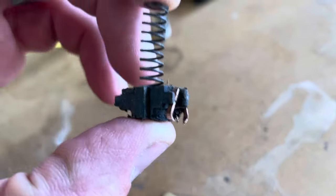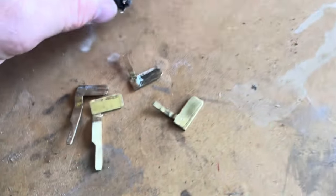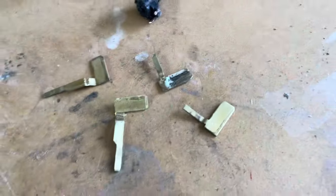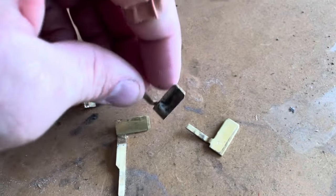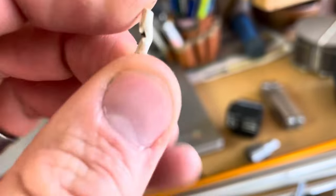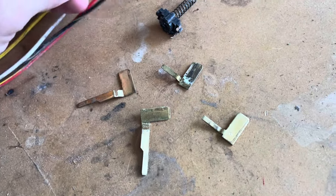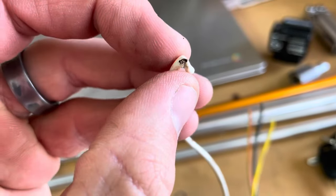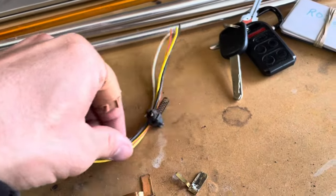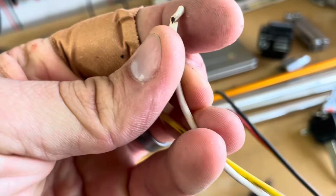Inside, you have a little spring for the seat — a spring-loaded piece that moves with the seat position. These two little contacts on the side ride up and down gold plates. You had four pins, so as it moved it would connect those two pairs. You can see some corrosion on this one — not super bad, but I suspect a combination of the pinched white wire having high resistance and some corrosion on the contacts led to occasional high resistance interpreted as an open circuit, which the machine read as the customer not being in the seat. Even if the wire still feels intact, there might be a lot of resistance in there — always an important sign to note.